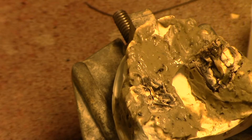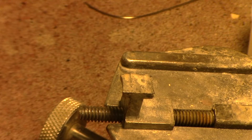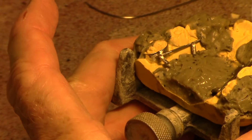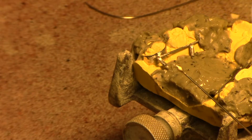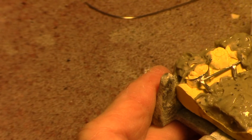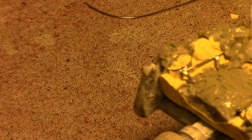Let me show you something else. If you're just starting out and having a little trouble getting the sweating process going, here's something that'll help. It's a variation of what I just did — I've got a wire with a blob of solder on the end. I can use this blob as my initial solder for the sweating. Let's try that out on this solder joint.